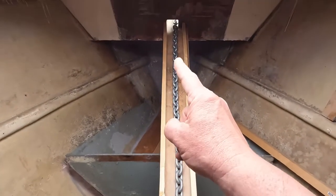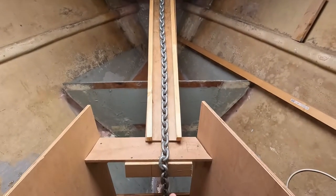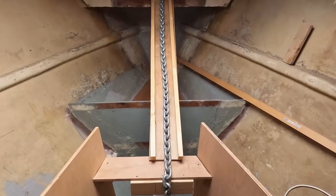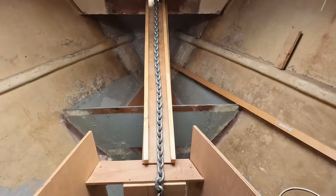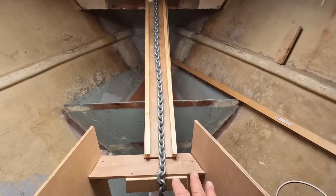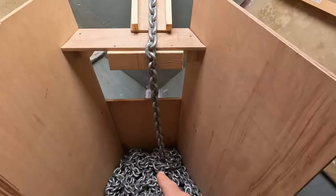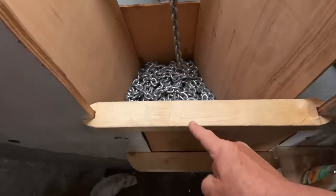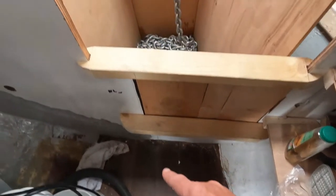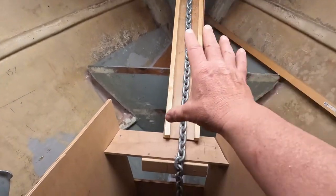Having put the chain there — which is well over a meter further aft than it used to be — the key question was how do we get the chain to go there. I've got a prototype chute coming from the old anchor locker, and the good news is the chain, even without anything non-slip on there, is flowing down beautifully. Whilst it looks huge, it will be boxed in neatly and made watertight, so any water that comes in with the chain will go to the chain locker, which will have an exit hole for water and a pump under the floor.